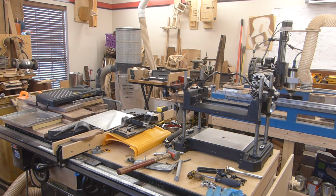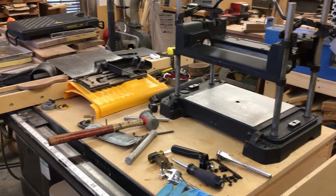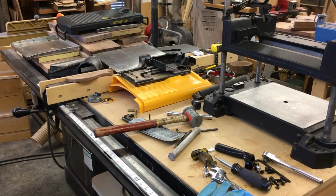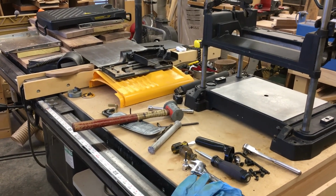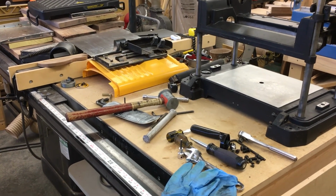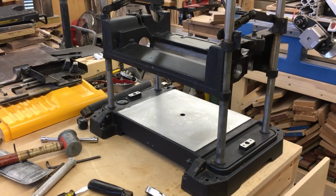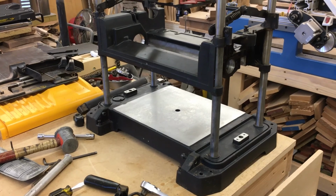A few days ago, my 20-year-old DeWalt 733 planer gave up the ghost. After exhaustive testing and diagnostics, I've determined that the field windings are open, and that just means I need to get another planer. So I decided to repurpose this one as a veneer press, or small parts press for gluing boards.